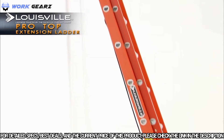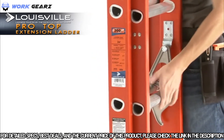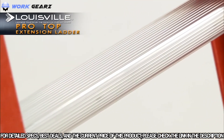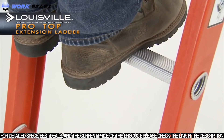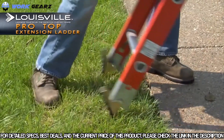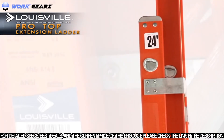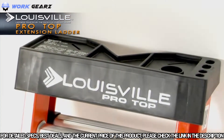These extension ladders featuring the ProTop are equipped with the exclusive RungLock QuickLatch — a one-finger operation for quick and easy locking when the ladder is extended. They also have D-shaped tempered aluminum rungs, hydraulically double-crimped to the side rails and serrated on top for a slip-resistant surface. The D-shape provides greater standing area than round rungs. The full swivel safety shoe can be used tread-down or in spike position. Two extra heavy-duty outside slide guides, secured with four rivets per guide, provide maximum strength, and a stop on the fly section prevents overextending. ProTop fiberglass extension ladders, exclusively from Louisville Ladder.